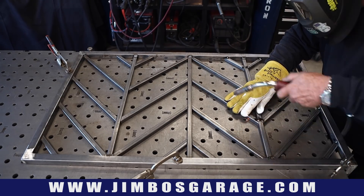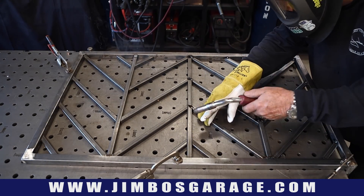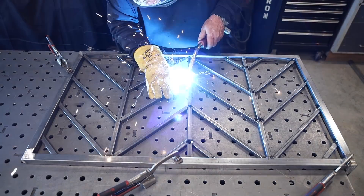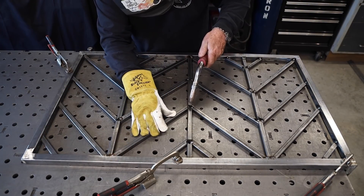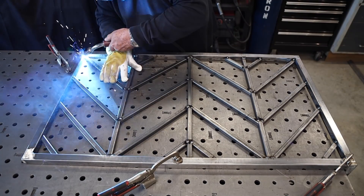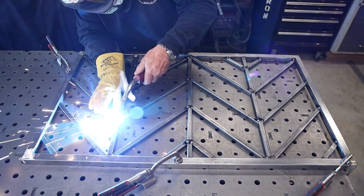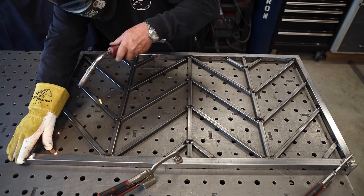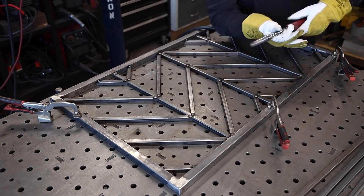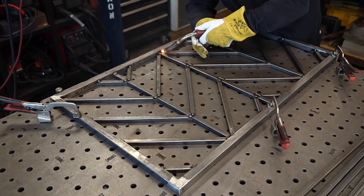The frame is one-inch square tube, and this is 5/8-inch square tube on the inside. You can see I'm holding that flat to the back side — when the screen goes on the back it'll be flush to the frame, and the little recessed area in the front gives it a really nice definition. I did pretty good with these cuts — I used one as a template for the remaining pieces, and they were close, within a 1/16th or an 1/8th. Overall it turned out pretty good.